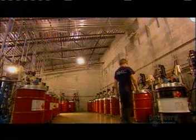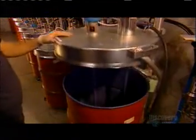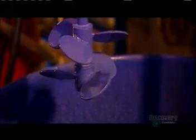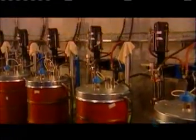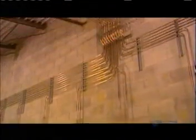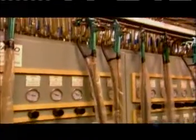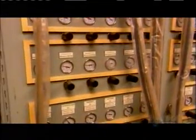The staining operation takes place in the part of the factory known as the paint kitchen. Each tank has a mixer inside to keep the stain well blended so that the pigments don't settle to the bottom of the tank. This ensures the color will be consistent. There's a separate spray gun for each stain color.